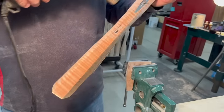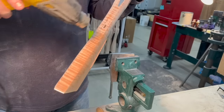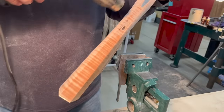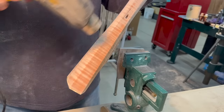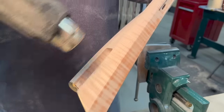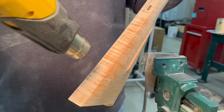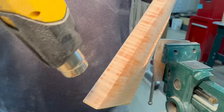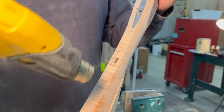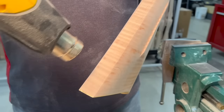Now, depending on the type of wood, how hard it is, and what kind of trauma the wood received while it was being shaped will depend on how much grain raising there is. So this is a piece of red maple. Not the hardest of wood, but pretty hard. As far as red maple goes, this is a good piece of red maple. And when it was shaped with sharp tools, so we, of course, shape on machines that use rotating tools and slice the wood pretty well, I can see that there's not a lot of grain being raised on this, because there's not a lot of compression or trauma that the wood received. Now in comparison, a gunstock that was shaped with a rasp by hand has a lot more compression, and you'll see more grain raising in those cases.